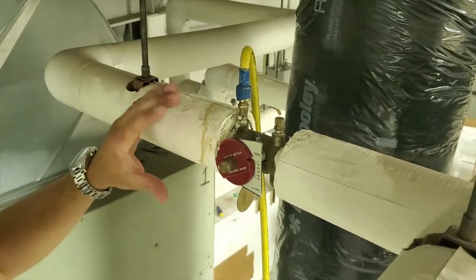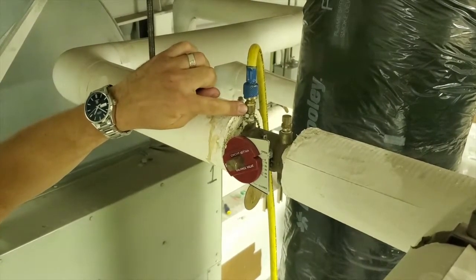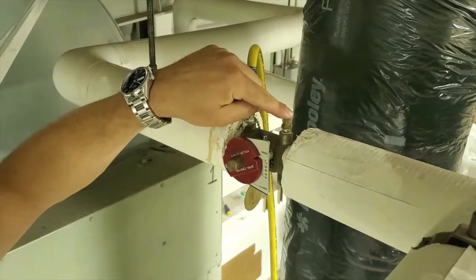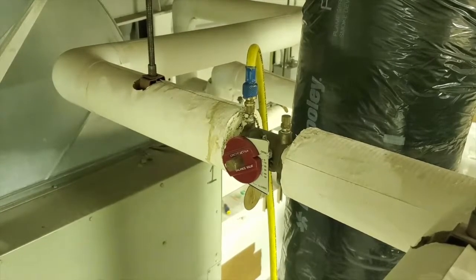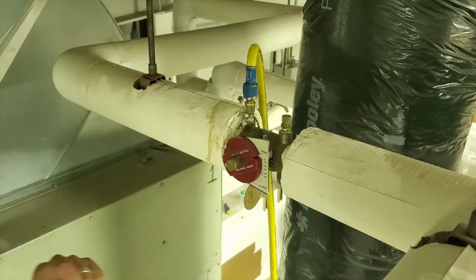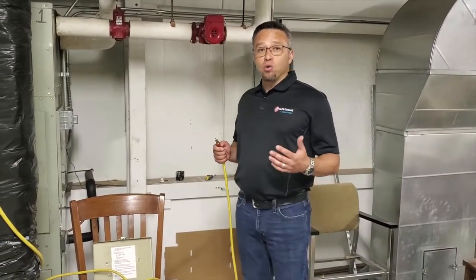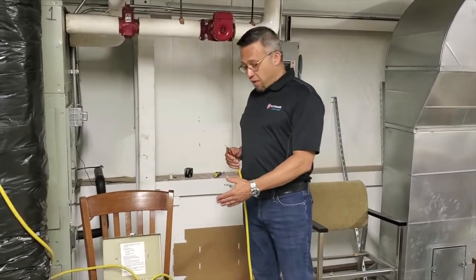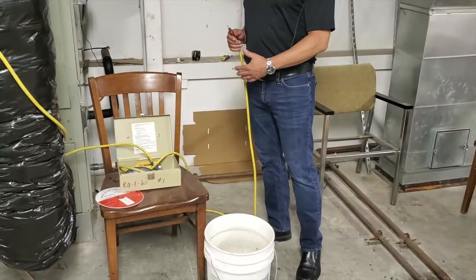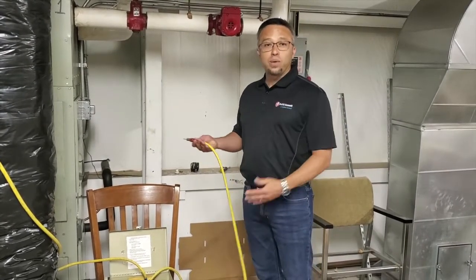Now that we are looking at the system, we've connected our high side to the high side readout port. We are going to remove the cap to the low side with the valves turned off or shut off on the RO meter, and then flush the low side line. We've connected our readout probe and hose to the high side of the balance valve. We will open up the high side valve and the low side valve on the RO meter so we push any air that may be in the hoses to get accurate readings.